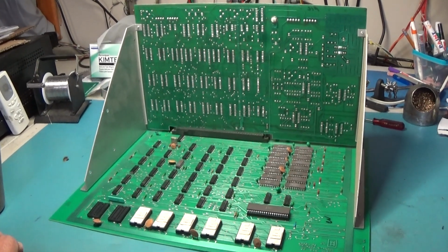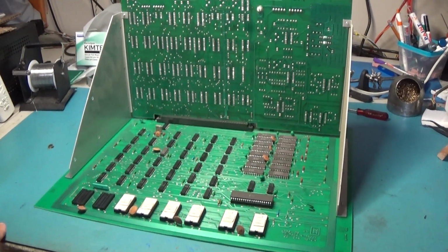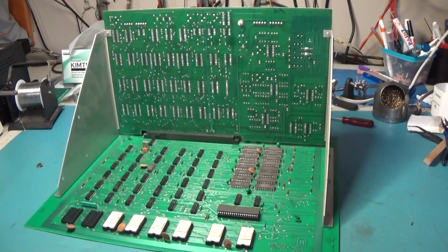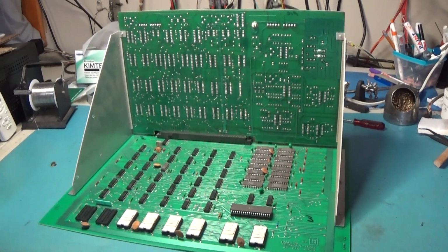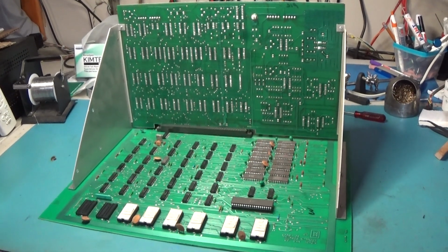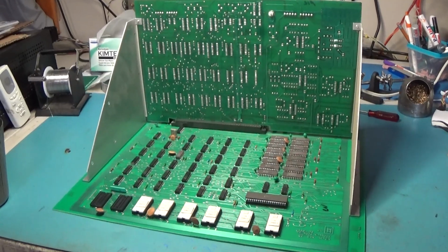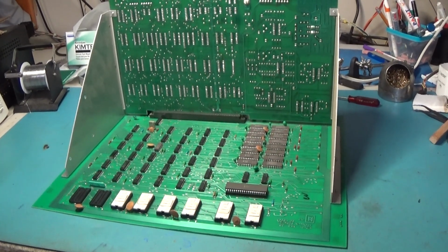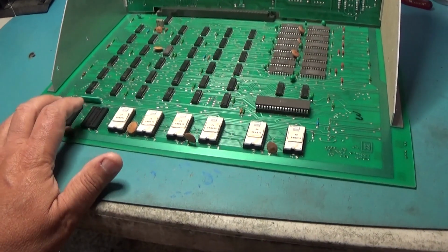Well, I got a board in for a repair that one of those people who said that to me about sockets had repaired, and guess what the only thing that the board needed was? Take a wild guess. You guessed it. Sockets. The sockets needed to be replaced. So I thought that was a funny little story that I'd share. Connections are everything on these old boards, and especially those old Atari sockets are just trash. They're time bombs waiting to die on you. So those always need to be replaced. These ones are probably garbage too.